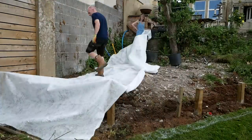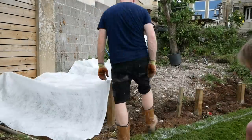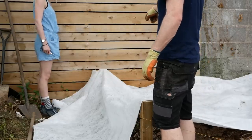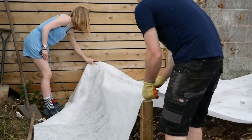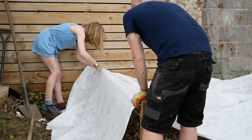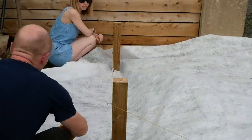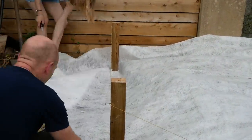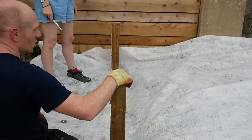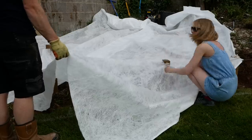Now before you say it, this step is a little bit backwards. Ideally you want to clear off all your topsoil so you're down to a decent subgrade, then lay a geotextile — this is like a Terram non-woven fabric. That goes down to support all your sub-base and I've covered it all in previous patio and path videos. I wanted to get that down and fold it underneath the sleepers, so what we're doing here is installing it and cutting it around the posts. We're folding it back on itself so we'll be able to backfill with clean gravel and keep everything away from the sleepers, because you don't want soil washing in over time and rotting those sleepers.